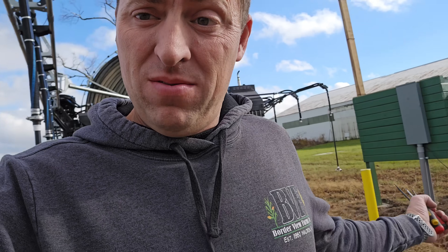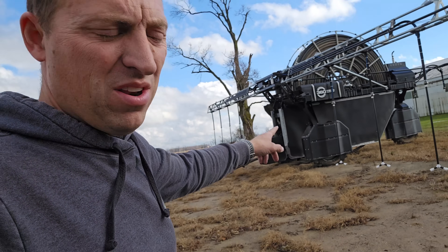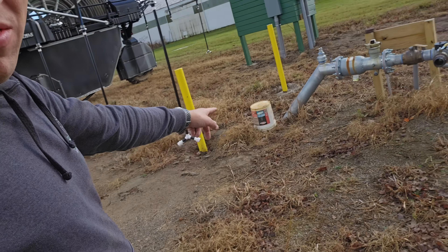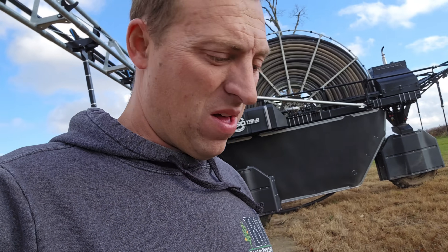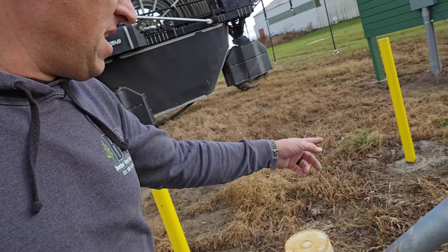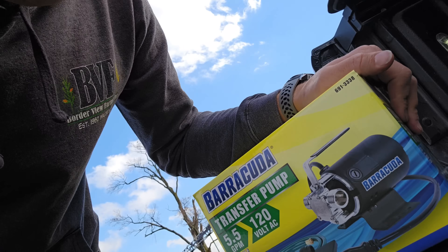I made it back — we're up at the rain field here. We got a big air compressor and blew this machine out, so there's not really any water left, not enough to be concerned about. We blew out this pipe underground, but there might still be a little bit of water because I don't think we were able to just blow it all out. While it's buried it shouldn't freeze, at least out in the middle of it. There's a six-inch tube to the ground level there, and if there is some water in there, it could potentially freeze. So I want to try and prevent that, so I bought a pump.